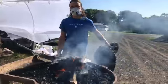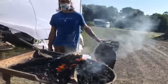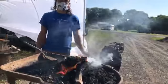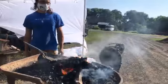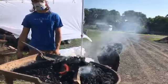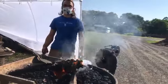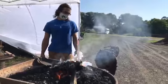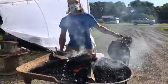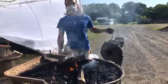And you can find that steel in a lot of places. I mean, some people buy stock, but really you can get it pretty affordably just at the thrift store, or any used hardware stuff. So this is a masonry bit. Leaf springs off of old trucks in particular, truck axles, anything like that's going to be really hard. I have some friends that make swords out of truck axles, but it takes a couple of days to work it into a shape that's actually workable because they're just so hard.